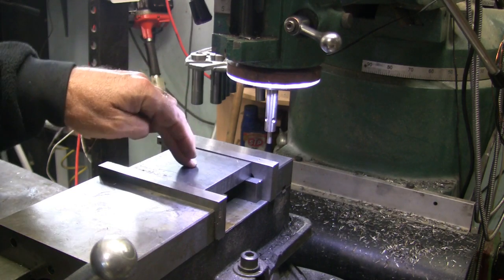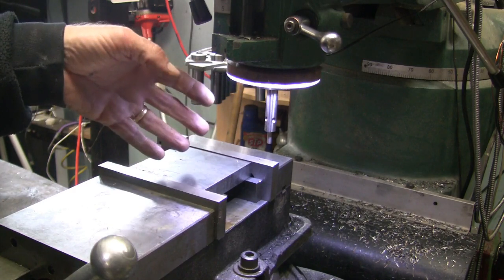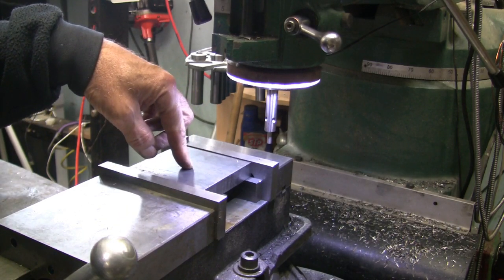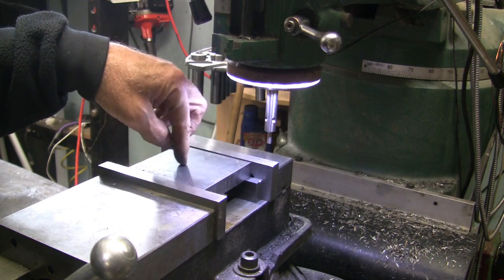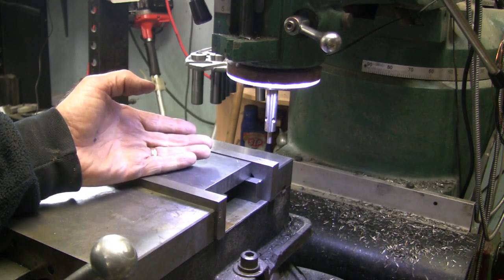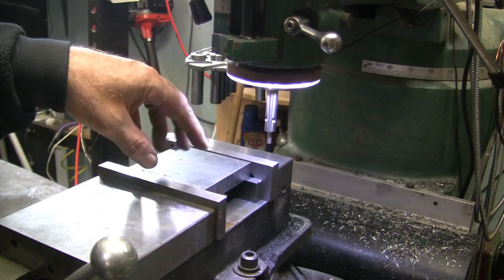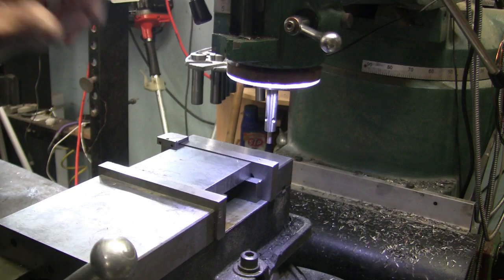This hole that I'm putting in is only so that I can get from one side to the other and be concentric with the opposite side. So I'll dial in that hole for my 0, mill everything on this side except for the OD, flip it over, and then I'll put it on a fixture. I'll be making a little fixture to hold it, and I'll clamp it through the spoke holes, 3 places.